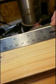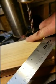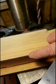So if you can take a few minutes now, get your boards, figure out which is going to be your top, which is going to be your bottom. So which end you're going to cut the bottom in like this on both of them. So get them together. And you want to measure from wherever you cut, the top corner to the top corner of the other one is going to be 6 inches. So now if you need to trim something up or cut something up or measure, remember the same thing. So if I measure 6 inches from here to here, okay, so there's my 6-inch mark. So let's say my 6-inch mark is right here. Again, 12 millimeters in is going to be a 7-degree line.